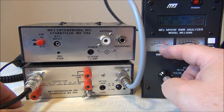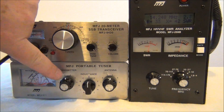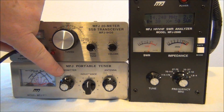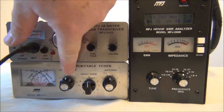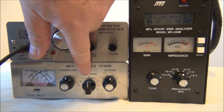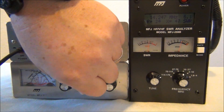What we're going to try to do is get the lowest SWR on the antenna analyzer by adjusting the manual tuner. As noted in episode 116 'Analyze This', Gordon West indicates that the first step is to ensure that the capacitance on each side is set to approximately straight up and down, and then we adjust the inductance knob to get the best SWR.